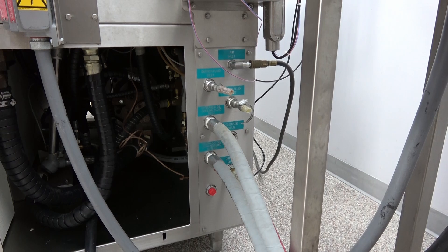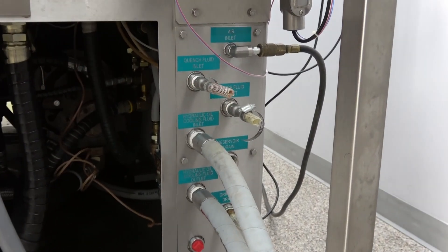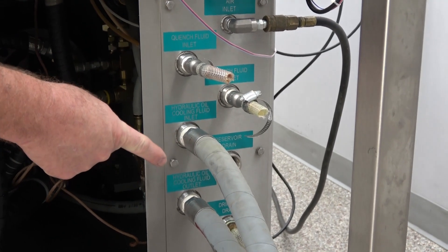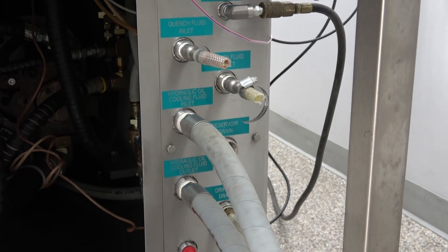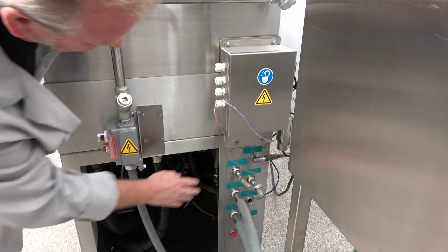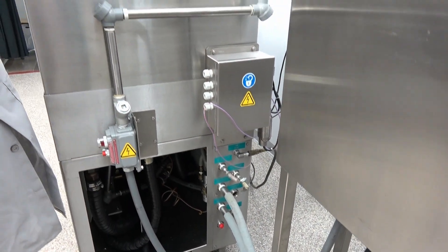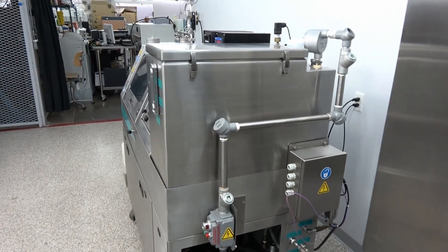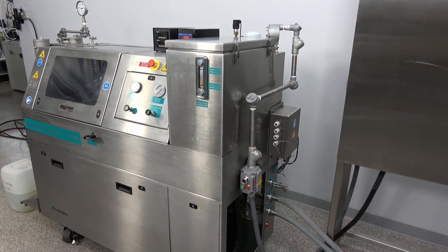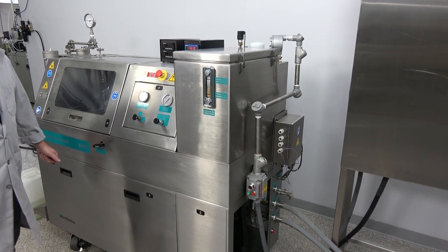Down here you can see all the hookups for your water cooling. The two big hoses are your main oil reservoir cooling. This one right here is your quench fluid that's cooling your actual pump head. And down here we have a drain pan drain, which drains the inside of any spills. Over here we also have the air connection, because this is all pneumatically driven for all your switches — pneumatic switches are a lot better, rather than having any chances of sparks with electronics.